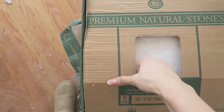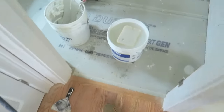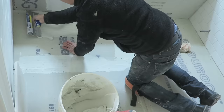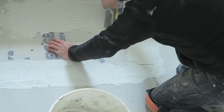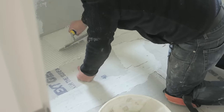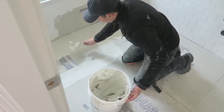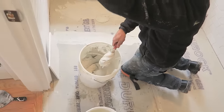This is what the marble looks like. It has a nice beige with a little vein on it. We're going to start by spreading a nice even coat across the floor to give the marble an even surface to lay on. But first it's very important that we fill in all the seams in the cement board so that the marble has a nice solid backing underneath, which will prevent it from cracking later on down the road.